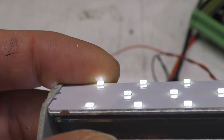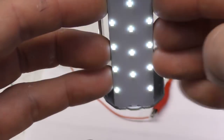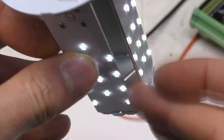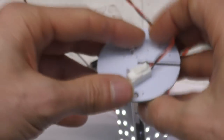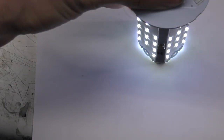So even if you go pretty much right to 180 degrees, they're still kicking out a reasonable amount of light. A lot of LEDs have maybe 150, 160 degrees, so you'd get a dark section here, but these put out enough light on the side that, by playing around with the spacing, you get fairly even illumination. If we'd used narrow angle LEDs, we'd have got quite a big dark shadow on this angle. But in fact, it's almost the opposite. We've almost got more light coming out here than off the face, so we don't have a great dark spot.